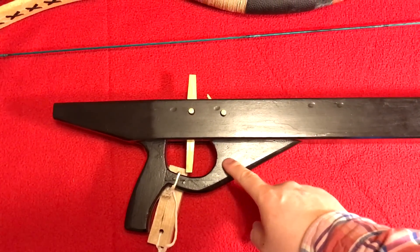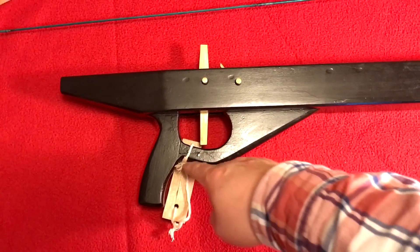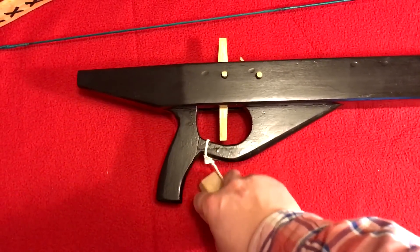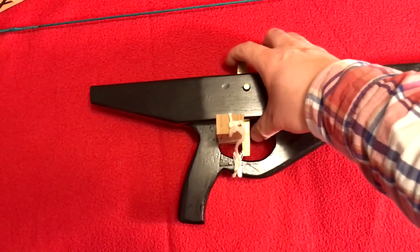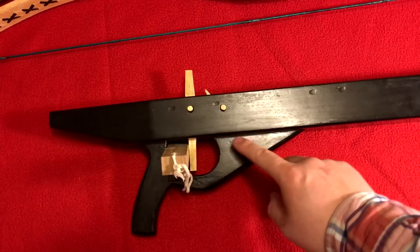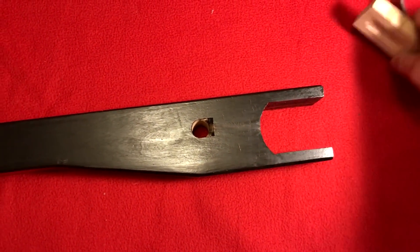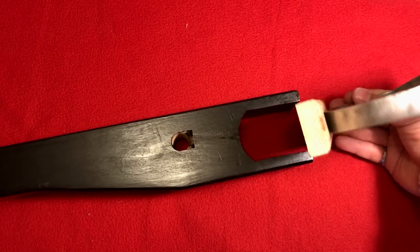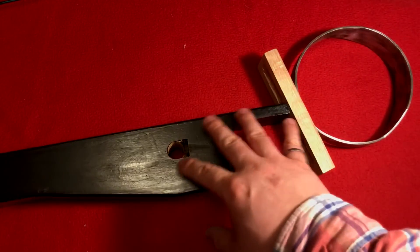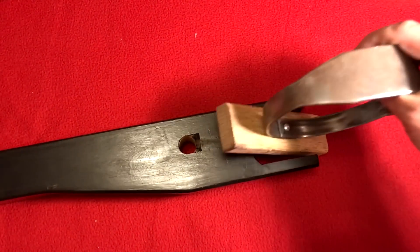One thing we added is the grip — we're not too sure how it was historically made, so this is a very intuitive approach. The trigger guard is important because there's no spring here, so having a safety feature prevents accidental dry firing, which is very useful for the craftsman during testing. The trigger guard also prevents bumping into the trigger while loading. For the receiving end, it's conventionally mounted like Europeans mount crossbows — our assumption since we don't have enough sources, but we do see the stirrup and lashings, so logically there's some lashing method here.